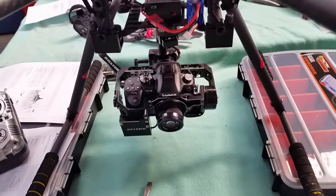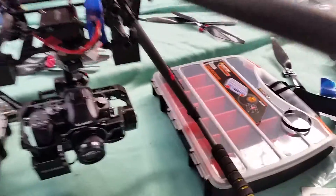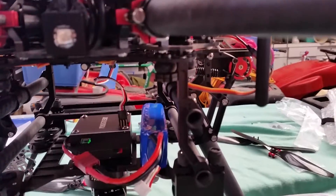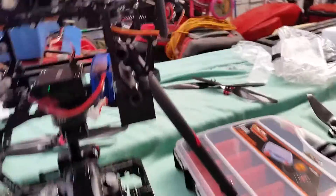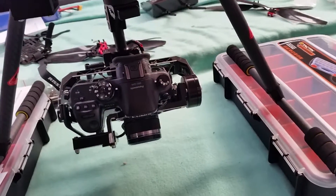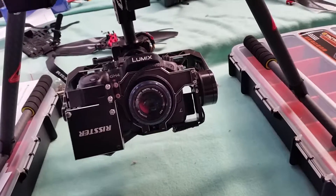Rechecking this gimbal, this wrist gimbal. With the connector on the most rear three pins, I can actuate the pitch and it does work. However, at an extreme it develops a very nasty vibration.